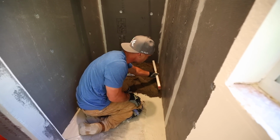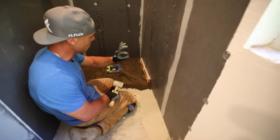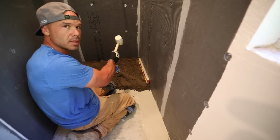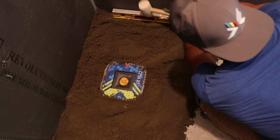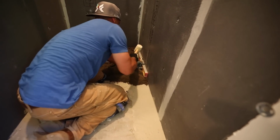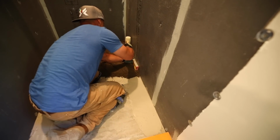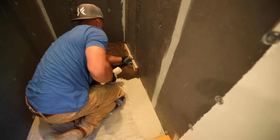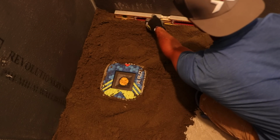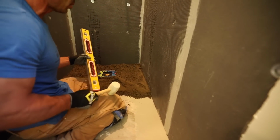As you're setting your perimeter screeds, you just want to make sure that you don't pack. You want that mud sitting up about a quarter inch to a half inch at the most, unpacked, as you're setting these screeds, so you can easily tamp down the edges and form that screed line. Go. She leaves that really nice screed line that we're going to work off of.